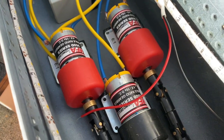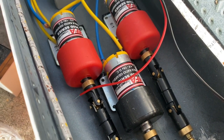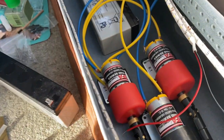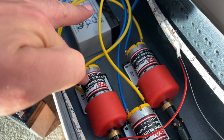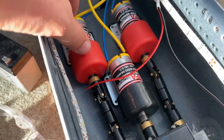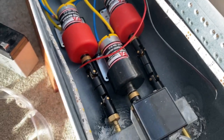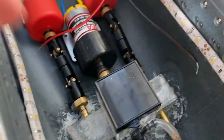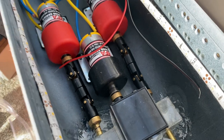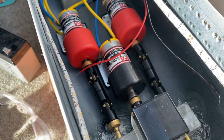The other thing that I did, and it's well worth doing this if you're anxious about battery power and battery operation time in your boat, is use your multimeter, if you've got one, connected in series with one of your motors. Because you can monitor the amount of current flowing through the motor, and then make subtle adjustments in the motor to try to reduce the current as far as possible. Basically, this means you reduce the friction in the prop shafts to such a point that the motor's operating as effectively as possible, using as much of the energy from the batteries as possible and converting it into kinetic energy in the propellers.